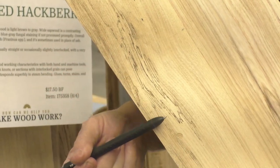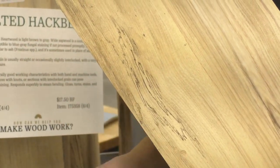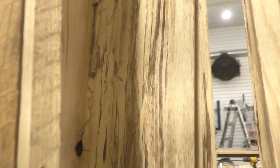Let's talk a little bit about spalting. We've carved several pieces in the last couple of years that are spalted and it looks absolutely spectacular, especially with a finish on it. The thing to remember is spalting means the wood is starting to rot, and that area becomes much softer than the surrounding unspalted wood. So you may have a combination of hard and soft — a really big difference between the two — and that's something to definitely take into account.